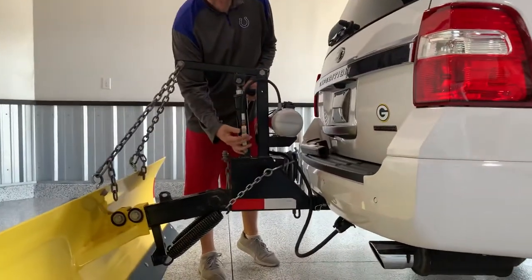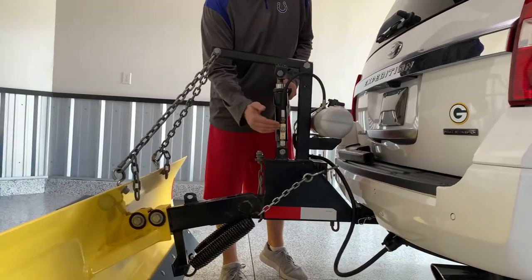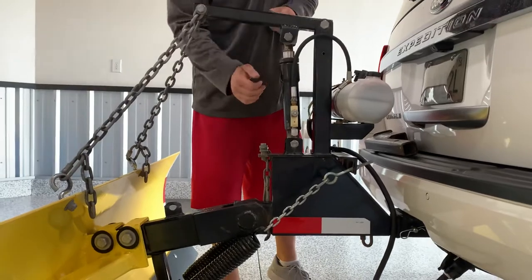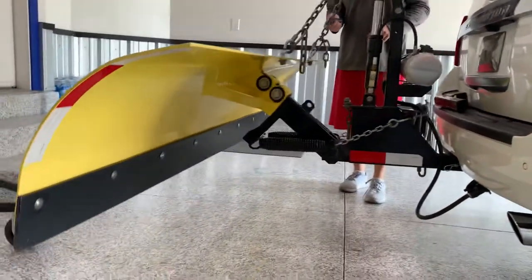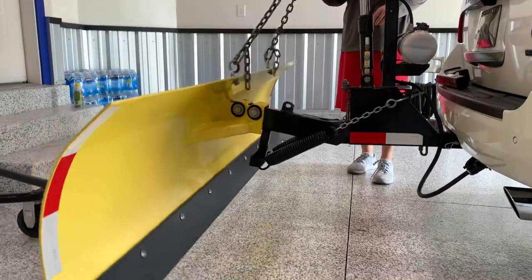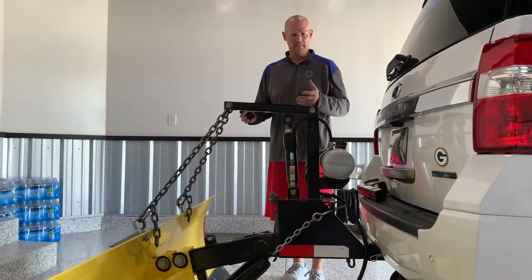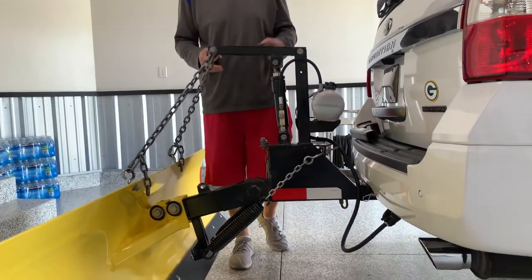There's this dial right here. If you loosen it counterclockwise, that's going to allow more fluid to go out to the reservoir. Fully raised — and there's your drop. You can see how that dropped a lot quicker than the last time because it's allowing more fluid to rush through that line.